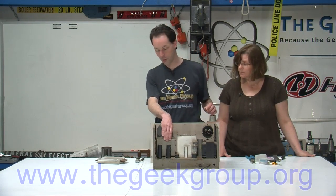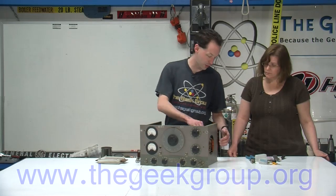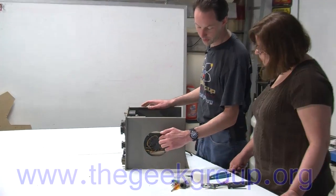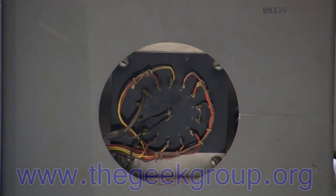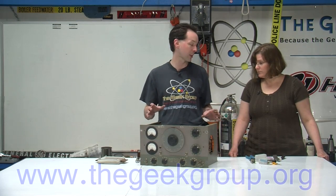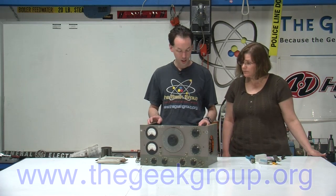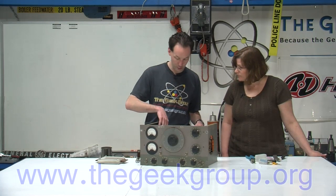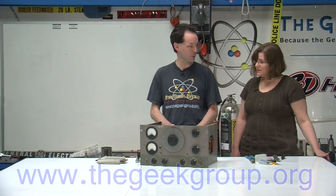Now there's this thing, which is a big transformer. It really sucks because I can't get into it — it's a sealed box. You see these in older equipment but not so much anymore. These are all the terminals in the transformer, and the values on it are known to Hewlett Packard and probably nobody else. HP and General Electric do that with these a lot — it's a transformer made specifically for this. It's probably the main transformer for all the various voltages. These two big ones are probably the filament transformers, because we have thermionic emission.